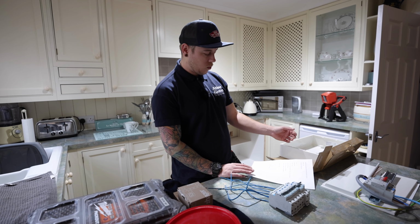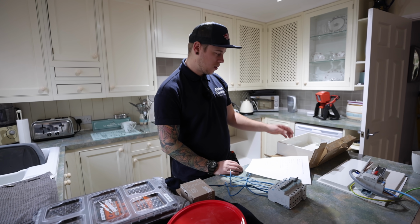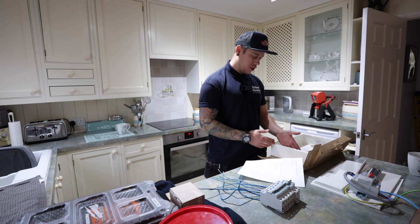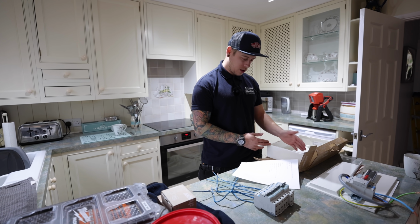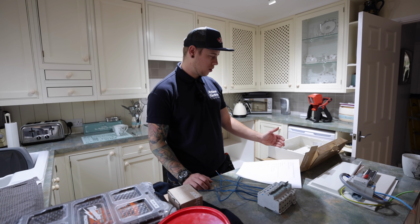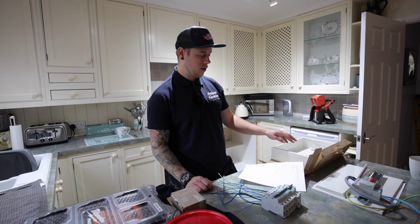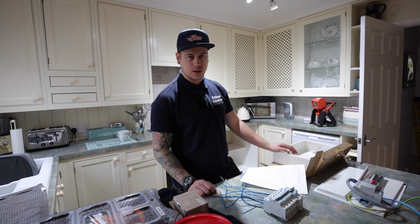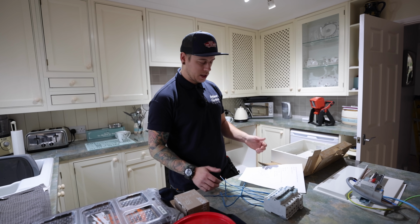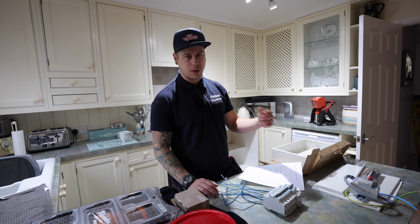So when I've got the board off, my cables are numbered 1, 2, 3, 4 onwards. And then when it's in the new board, I can literally just grab the cable. Right, I want to put circuit one away first, find number one, put it in. As long as you're doing that, you can't really go wrong, as long as your numbers don't fall off. And another thing I like to do before I stick the cables away in the breakers is, if I need to do an end-to-end test on the ring main, I'll have my tester next to me and I'll do it, and then it can be dressed into the board and it's not got to be pulled out.